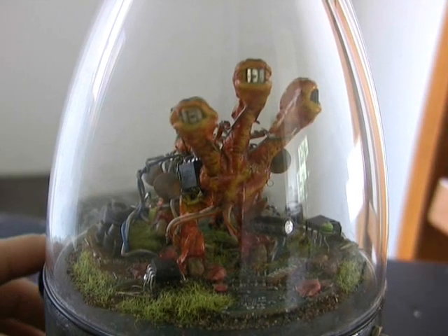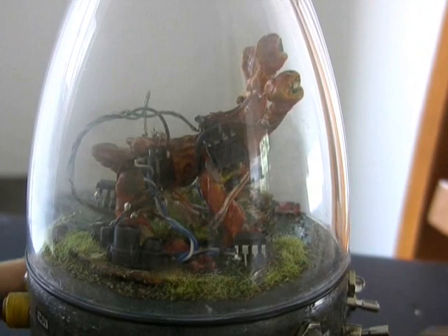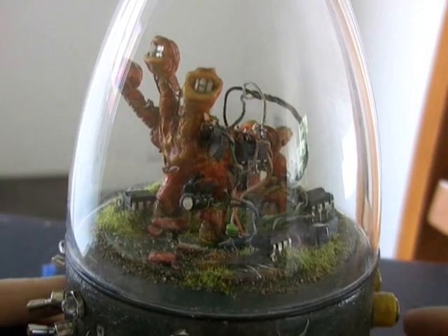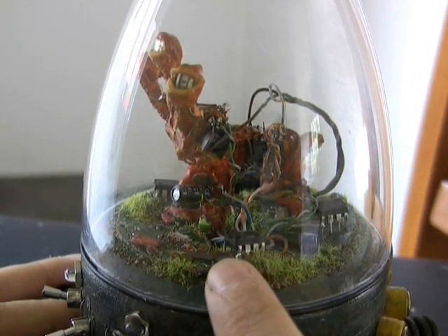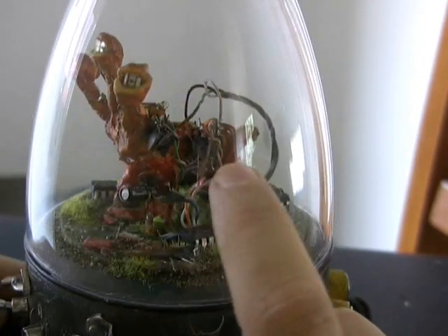Here's the bug sculpture — a three-eyed monster. You can see the circuit components embedded inside the body, and these little offspring 555s here are sort of giving birth to a clutch of new chips. They actually serve a purpose: if you measure the resistance between pin one and pin five on those 555 timers, that's 10k, so I'm using them as the resistors for the astable oscillators — no discrete resistors at all. The timing and decoupling capacitors are also part of the body.